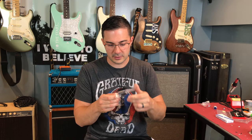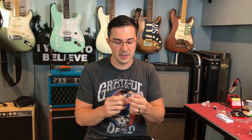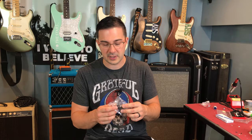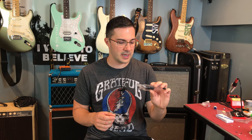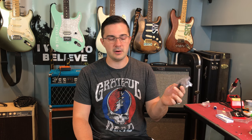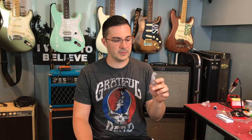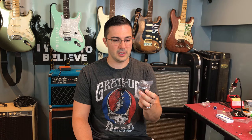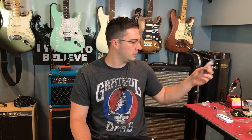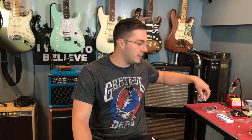Also, what I got in the mail is this 47µF 500-volt capacitor. This is for my Hot Rod Deluxe — it's going to stiffen things up. Sometimes when you're playing and there's a heavy bass thing going on, it'll start to flab out, and that's one of the complaints about that amp. This will stiffen up the power supply and give it that extra little boost. Another alternative is changing the tone stack to roll off the lows, but I'm not going to do that.